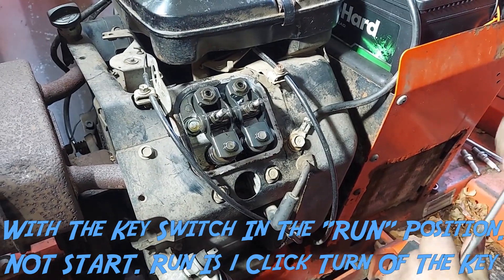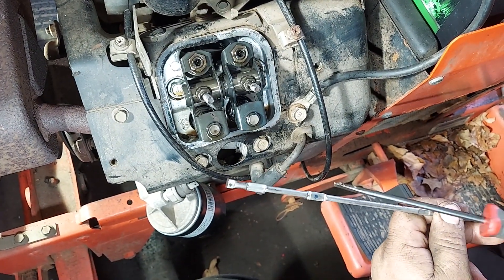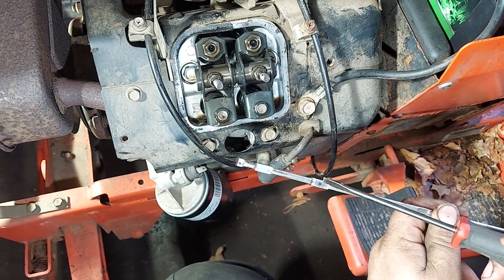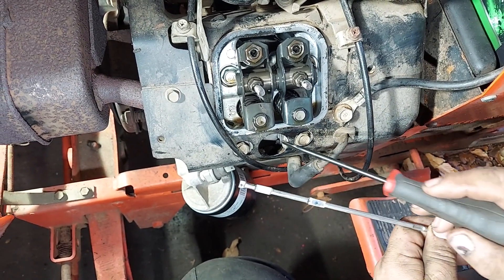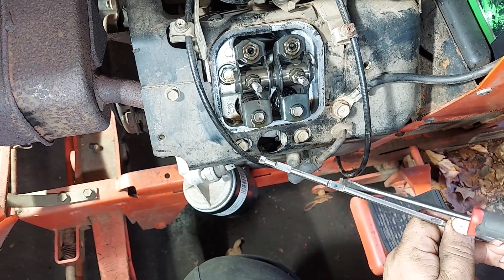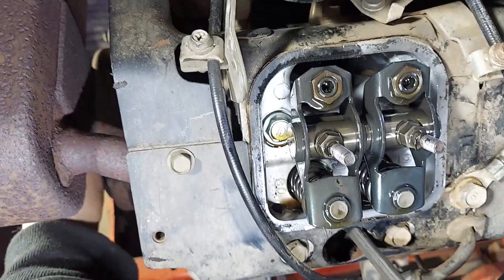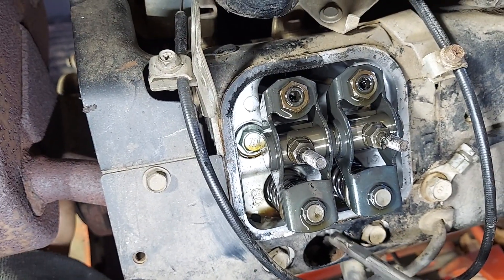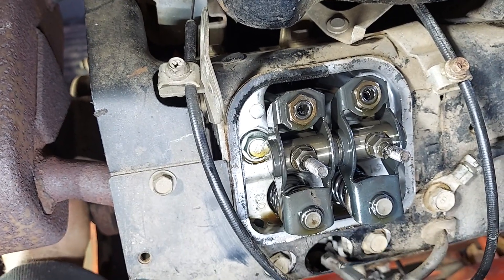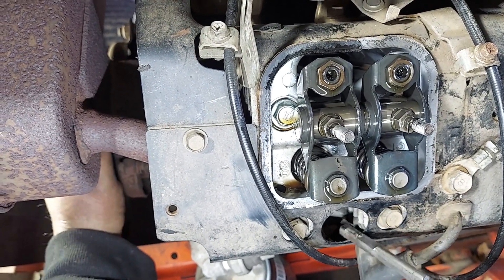Turn your PTO on - you've got a safety switch so you wouldn't be able to start it, but turn your PTO on. If you've got a belt on here, take your belt off. We've got our stick marked because we do this all the time, so it makes it a lot easier. This mark is top dead center and this other mark is a quarter inch past. You're going to turn the front counterclockwise - watch your valves. On the intake stroke it'll go through compression, then power, and you'll watch the exhaust valve opening up on the exhaust stroke. When the exhaust valve is closing, the intake valve is going to open, so don't put your stick in yet.